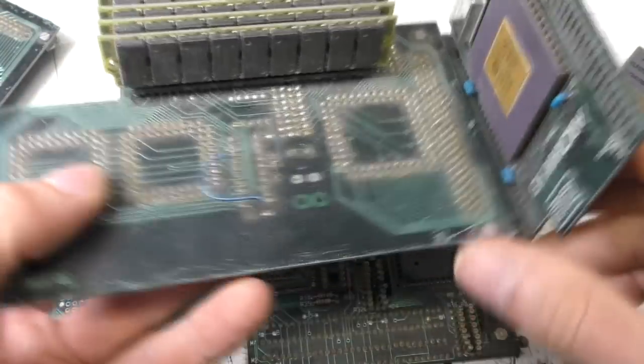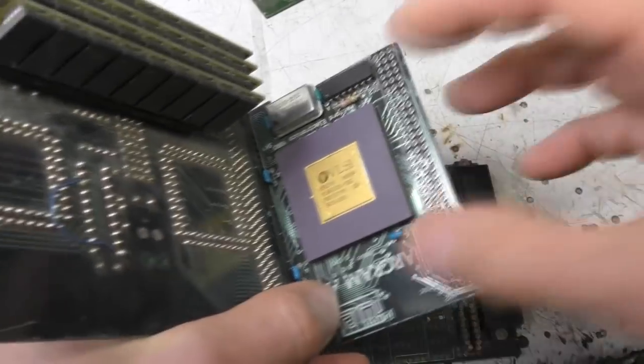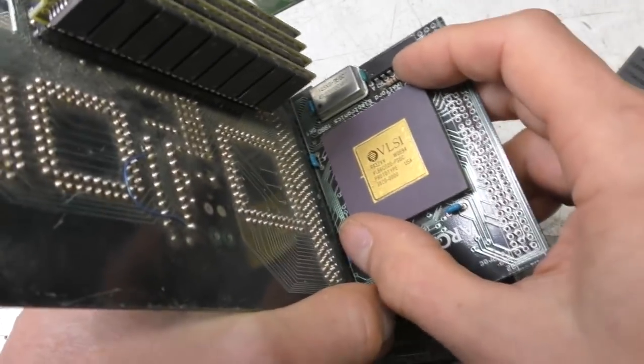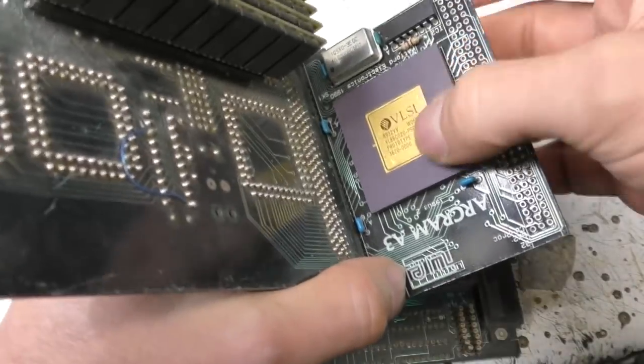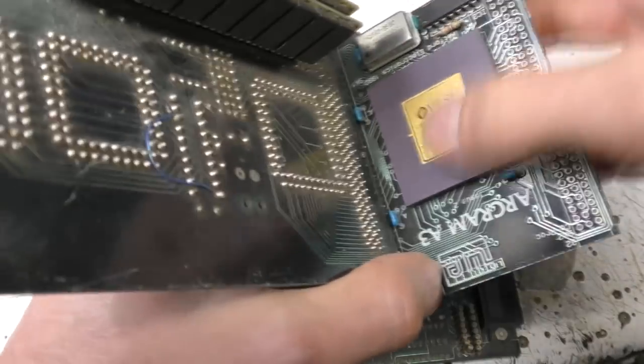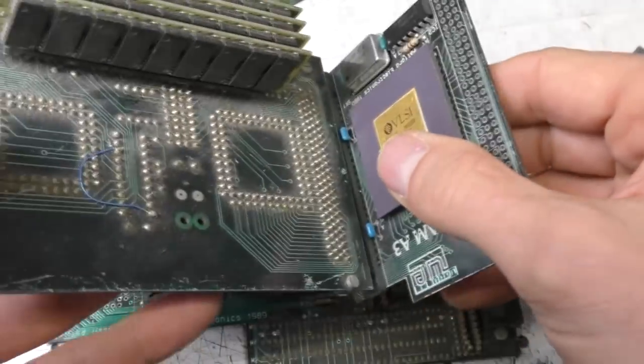The other thing these did was provide ARM3. Now the ARM3 was a faster processor which came out sometime after the original machines, and because they were designed so that the core was asynchronous to the bus, you could basically upgrade the machine by just plugging in a board that had this processor on it and a clock, and the core would run at 24 megahertz, but it would synchronize with the 8 megahertz system bus.